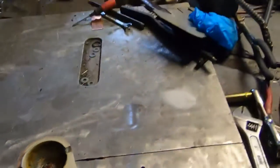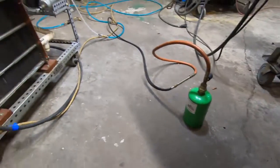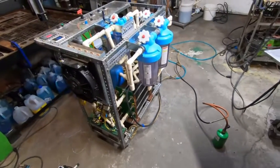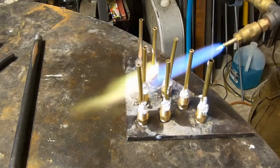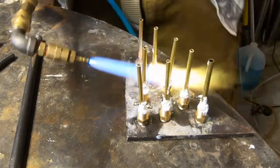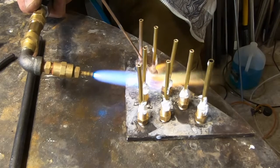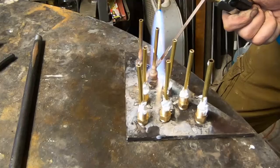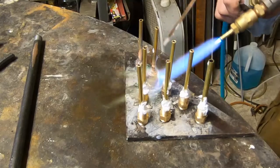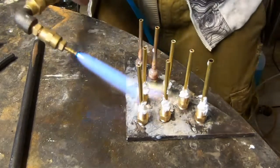I was doing a video for some people who were asking to see the performance of oxyhydrogen propane brazing. Basically, what we have is a 10,000 watt electrolyzer and a small tank of propane that will be infused with the oxyhydrogen coming off of this machine to make our reducing flame. People are asking me all the time about the performance of my oxyhydrogen torch and whether it's worth it versus just buying an oxygen bottle. I've done both, and I would never just go with an oxygen bottle — the power of this torch is just phenomenal. I'm now using the big $5,000 Mucho Mondo torch that Muhammad gave me, and this thing is incredible. I don't always infuse the gas with propane; I sometimes use acetone, but I've been doing the propane thing lately because I like the control you get with the flame.